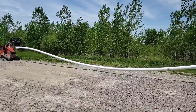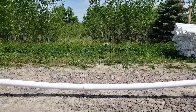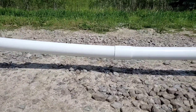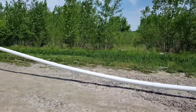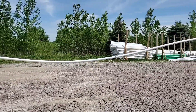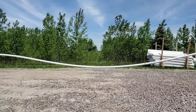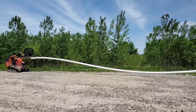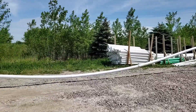There's 60 feet of PVC from skid loader to skid loader. We're probably close to a breaking point — stress fractures are likely already forming. I wanted to pick it up off the ground and show you just how much 60 feet of four-inch PVC schedule 40 will actually flex — look at that belly. It's absolutely crazy. The material is brittle and definitely under a lot of stress. I hope this demonstration serves its purpose as an educational piece on why PVC is so prone to bellies.